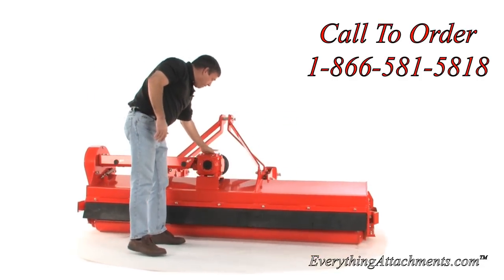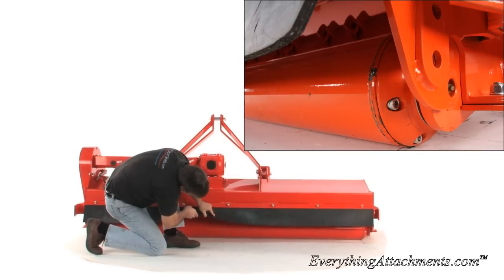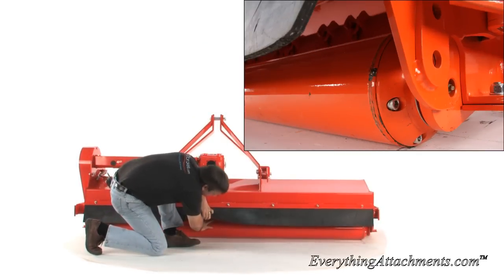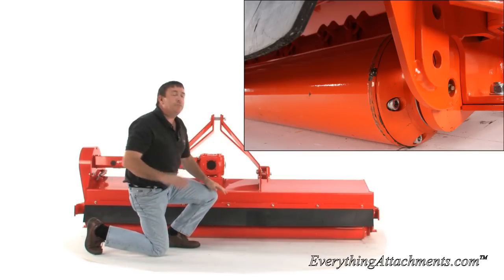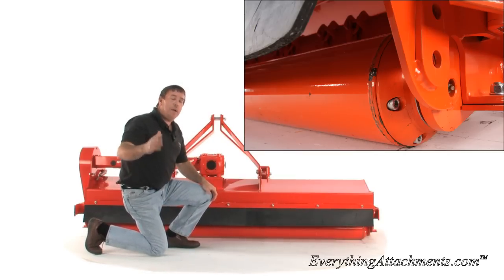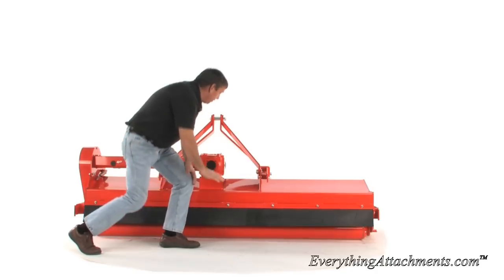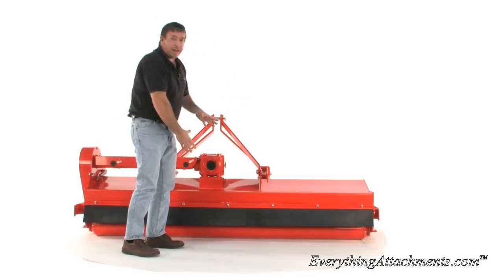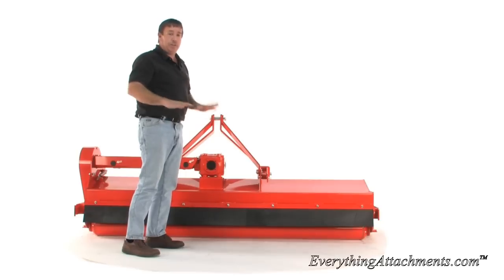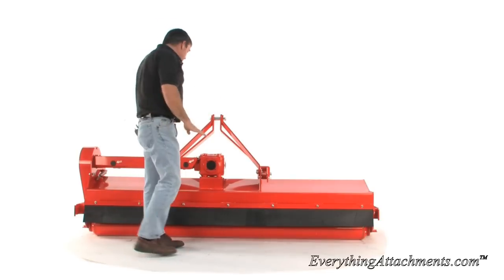It has a really heavy duty gearbox. Under this rubber shield, you're going to see a big round steel roller about this diameter. This mower is meant to roll on that wheel all the time to maintain its mowing height consistently. I'm going to show you how to adjust the rear wheel and the hitch — it's a combination of what it takes to mow level with this.